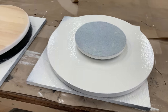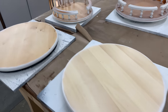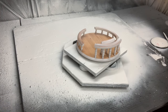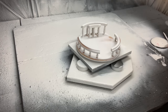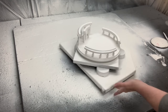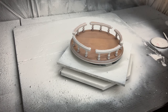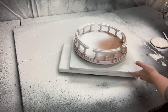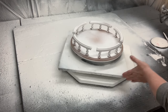Now it's the same process as the black. Once that white is dry, I can flip them over and start working on the other side. I do not do a clear coat on the white — I don't need to seal this in, it has primer in with it. It's definitely heavenly to get to use a sprayer on all these tiny little spindles. This would not be fun with a brush at all.